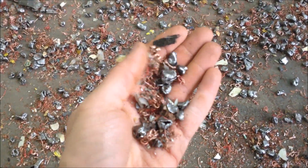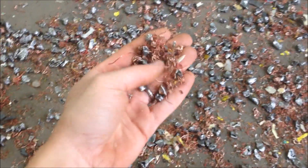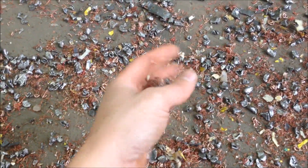So here's those busted up transformers. We ran them through the 2 inch and then I ran them through the 3/8 screen, and it ground all the steel up into little balls and all the copper wire is liberated. So I'm going to run a floor magnet over this and suck up all the steel and I'll show you the results.